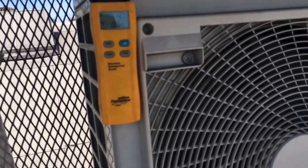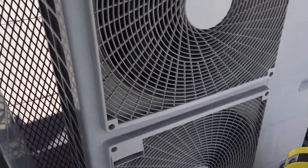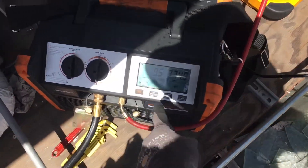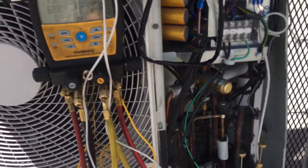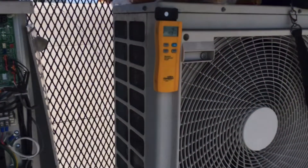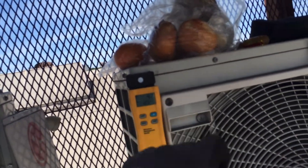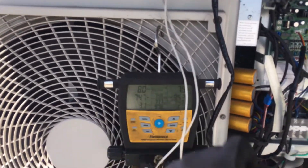Supposedly four pounds, one ounce — if the scale hooked up right. It looks like we're sitting at 375 PSI on the tank and we're already down to 9 PSI on the system side, 11 at the gauges because of restrictions — as you go further down, pressures differ. My video time is exactly six minutes, and we already have four pounds, one ounce. That last ounce area is starting to stabilize, and we're at 8 PSI.